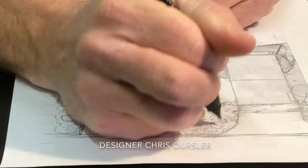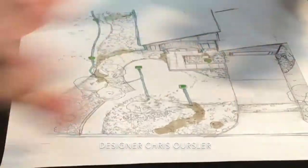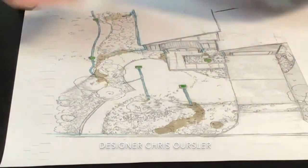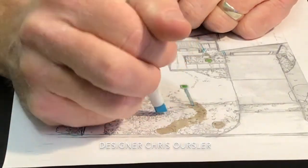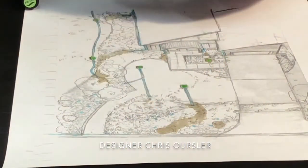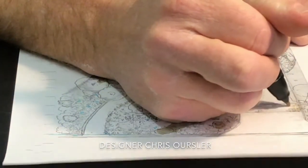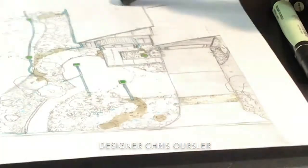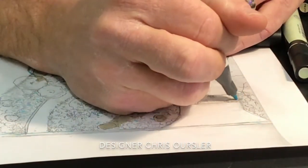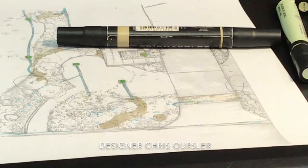So the water goes into there and fills this space. So we've got a little system going here, and we're getting water moving all through here. I also add a point here, and we can get into this discussion later in life, of driveway runoff and creating a permeable system, which also has a pipe running underneath it. Once you get through the aggregates, it filters through, and then we have a pipe that services an area where we'd like to reclaim the water.